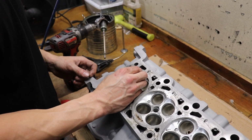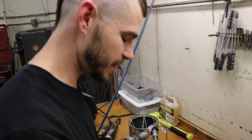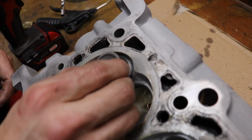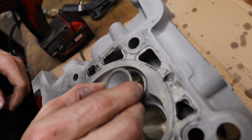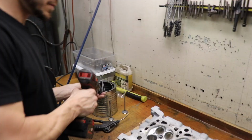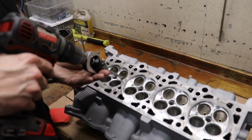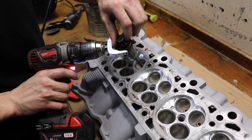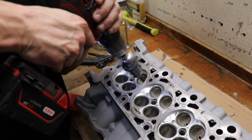Alright, that's what a properly sized exhaust valve should feel like, just like that. Nice and smooth, no hang-ups. Got a little bit of wiggle when you're pulling it out, but that's it. I know what that setting was, so this one, we're just going to use the same setting for all of them. We're obviously going to check along the way when we're cleaning the tool.